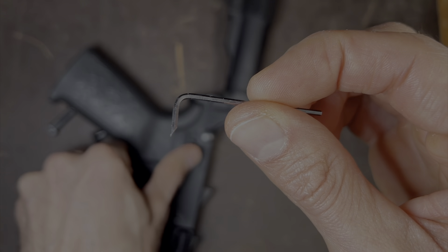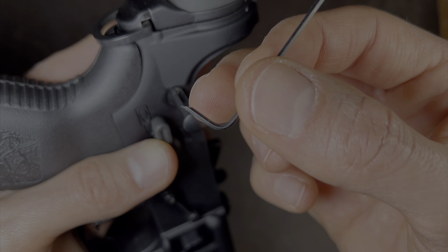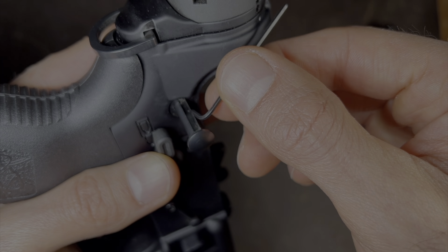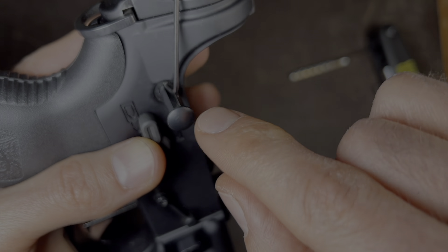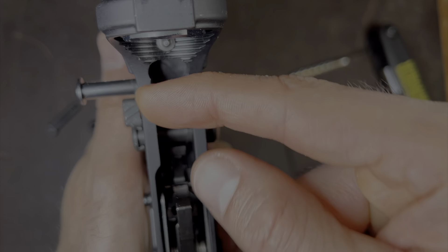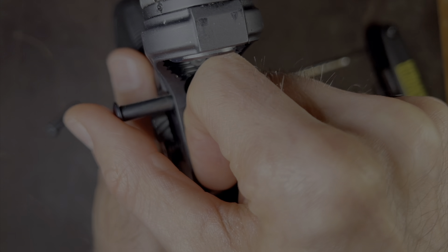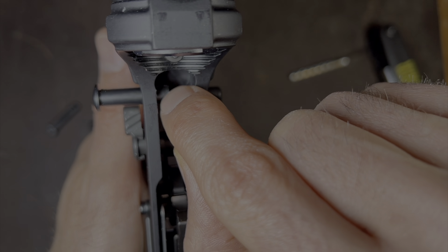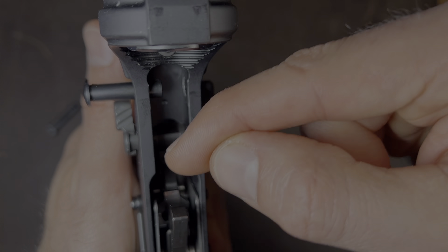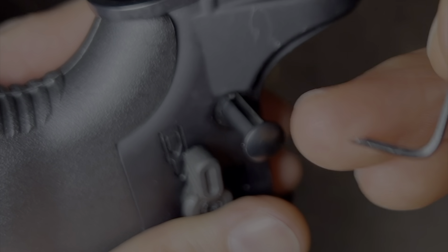This tool I was telling you about earlier — the pivot pin detent depressor — it looks almost like an Allen key. It has this little angle cut into it. How you use the tool is by putting this part with the angled part facing towards the detent, then put it into this channel. That angle part is going to go underneath the detent and then we can push the detent back. One important part is when you push the pin all the way, the detent goes into a little captive hole on some of these pins. So back it out just a little bit so the detent isn't in the hole at the very end. You want it out enough to get the tool in, but not so far that the detent falls into place.